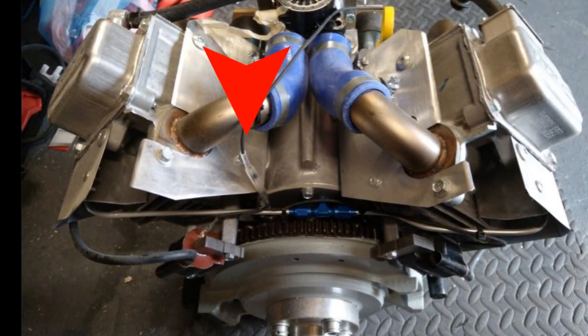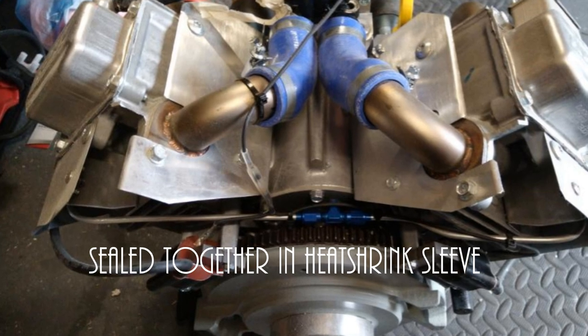So, what would cause this to happen? This is a diode. It's simply an electrical non-return valve. About a centimeter long, it costs less than a box of matches. The SC33 engine has two of these. The loss of one of them nearly cost me my aeroplane.